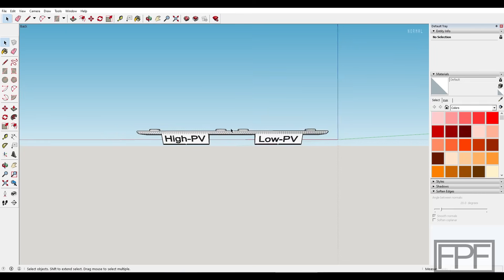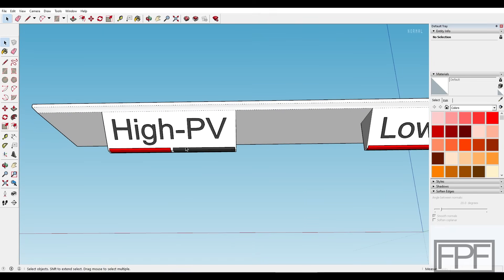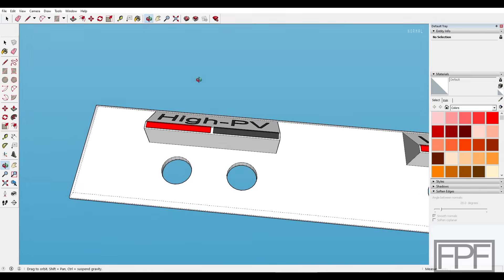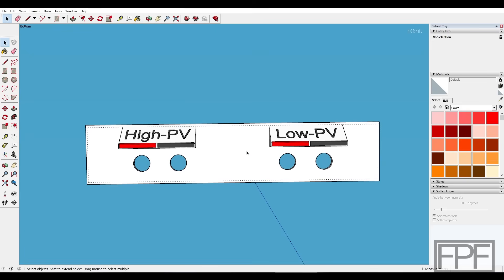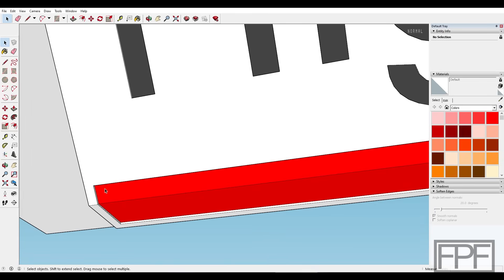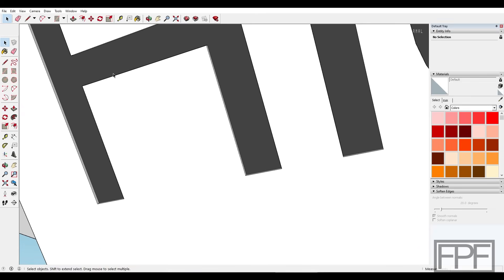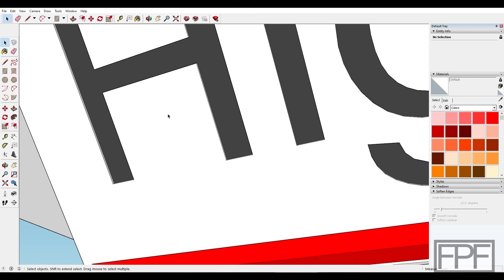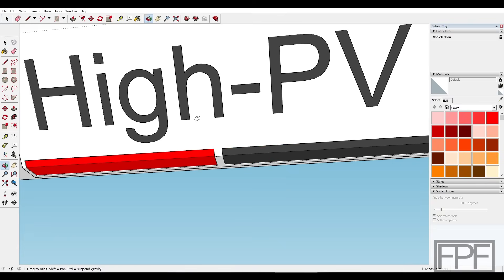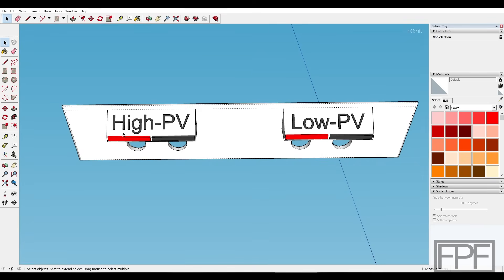This face here will be up against the bottom of the box. Looking straight on at the box, we should be able to read these just fine. The color wraps around the bottom and we should be able to read this from directly underneath as well. I often get asked how I do the coloring for letters and color-keyed parts like this. If I zoom way in, you can see I've extruded just slightly down — 0.1 millimeters — on the surfaces I want to be different colors. The slicer won't interpret that as a separate layer, but the edge tool in the slicer for coloring will allow us to just click in each one of these and fill them with the color we want. That way we don't have to export separate geometry to color them — for designs like this where I just want contrast in color, that's the quickest way to achieve it.